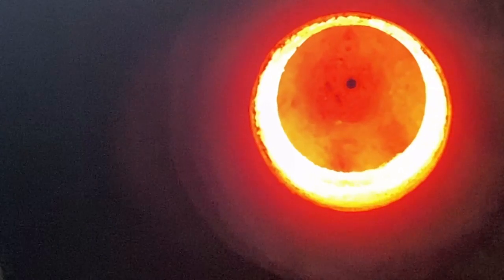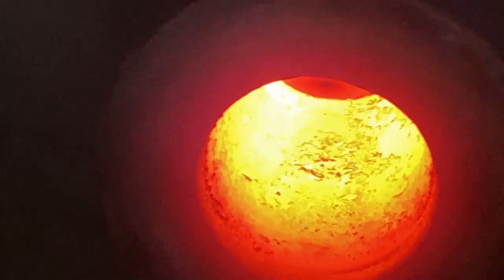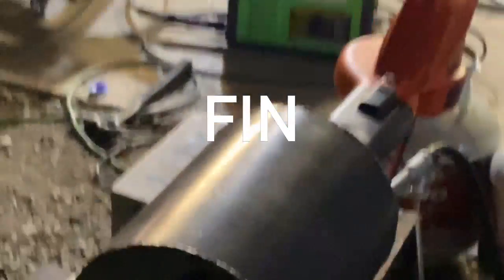Here's the reduced-exposure camera video I mentioned. If you look in there you see those bright flashes — we don't have a steady burn, it's like a campfire in there just fluttering around. We can improve that performance by changing up the way we mix the fuel. You can see that black opening — that was the fuel intake. Those other holes are the air intakes on the can liner. The actual can liner is smaller than what you're looking at, so those hole locations are compressed.